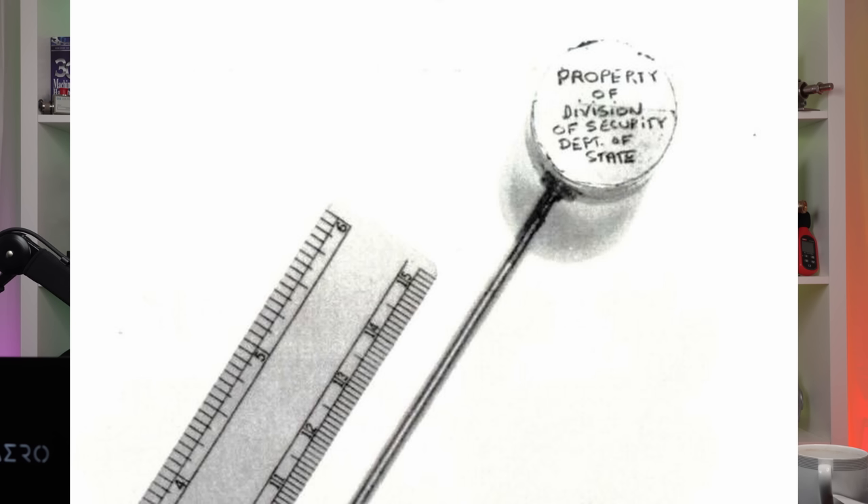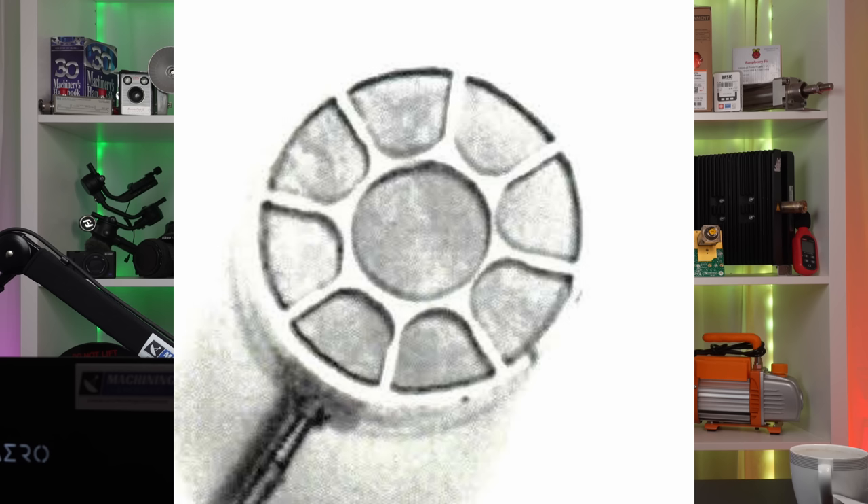Let's have a look at what the bug looks like. There's a cylindrical metal body a little under an inch in diameter and three quarters of an inch long, with a thin round rod sticking out of the side. The rod has a threaded end and fits through a plastic bush with an internal thread. The rod's two millimetres in diameter and the thread's a 0.4 millimetre pitch — in Imperial, that's about 64 teeth per inch. On one end there's a grille with eight pierced holes around a central round hole. On the other end there's a plain cap.